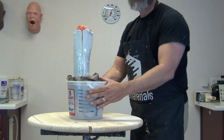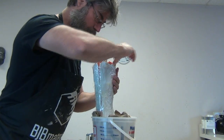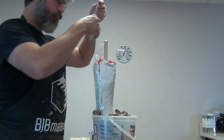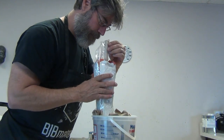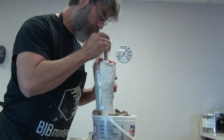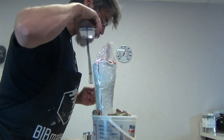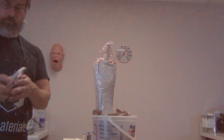This is going to look a little janky, but what I'm doing is using more packing tape to secure a three-quarter inch wooden dowel upright in there to simulate bone inside that forearm. Because this is a life cast mold, I don't have the advantage of making a nice jig as I'd typically do for a silicone block mold. I've secured that with packing tape, then I'm using the light on my iPhone to check and make sure that dowel rod is centered and doesn't touch the sides of the mold.